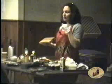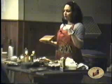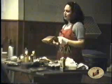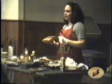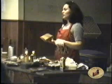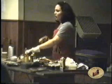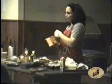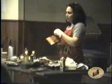It's amazing. So what you just did here, though, was shellac, but it's not a French polish. No, well, no. Traditional French polish is the pad and the handle. Well, what's the difference between the pad and all the elbow grease and just brushing it on? It has to do with the way the alcohol evaporates. There's alcohol in here, and what the pad is doing is moving your shellac around the surface, and your alcohol is evaporating at a different rate. You don't get nearly the same beauty or finish with the brush.